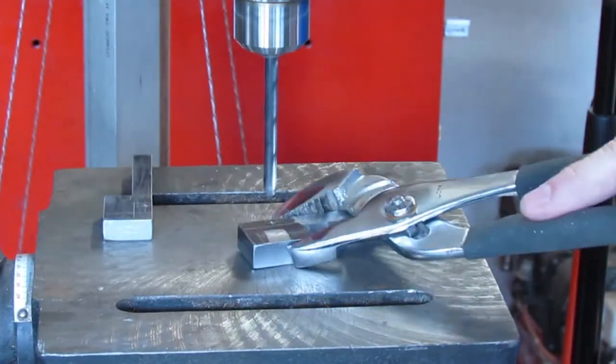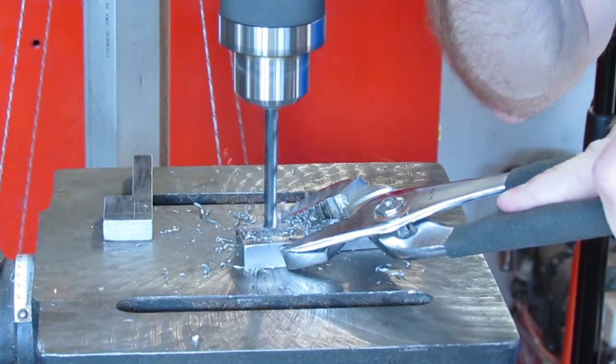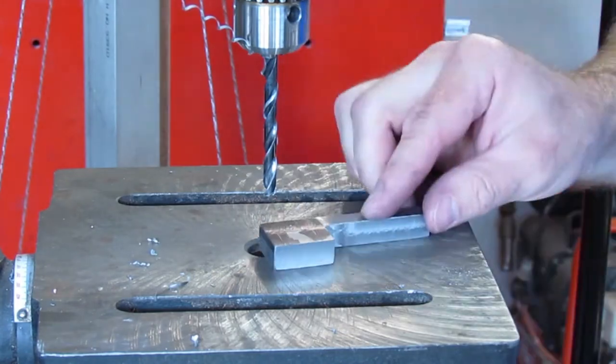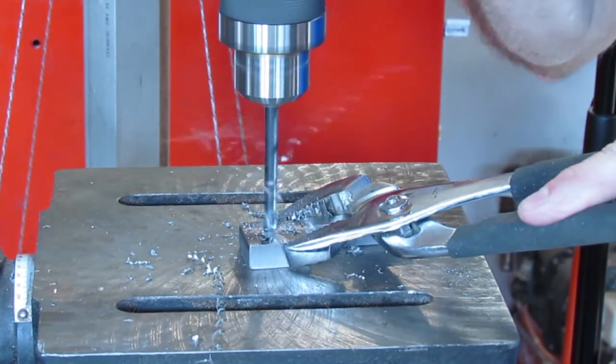Let's start drilling some holes. Using a 3/16 drill to drill out the corners prior to milling. Since this hole location on the holders isn't critical, I am not center drilling prior to actual drilling. If any accuracy would be required, I would have used a milling machine.